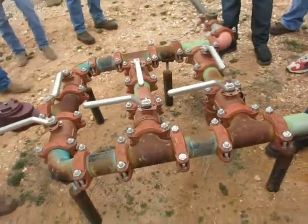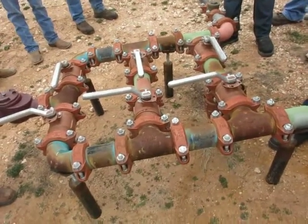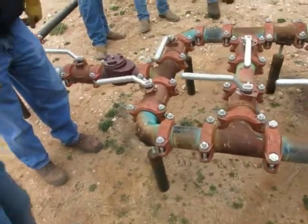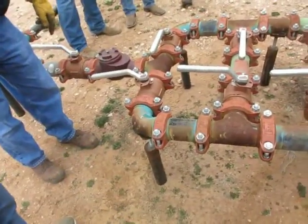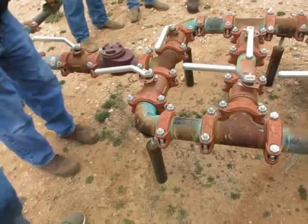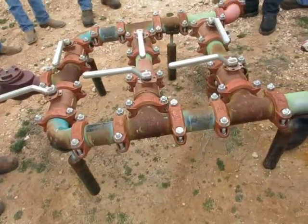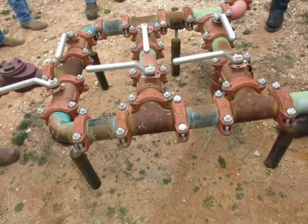What about if one of the wells has high pressure and the other one, like here, everything can mix? Right. So if they're approximately equal, we can bring them all together, and the check valves will keep backflow from going back the other way. Should these two have check valves as well? Yeah, on their lines, they'll have check valves. I just had to wait until I got number two and number three in before I shut the header. Fair enough. So those would be complete wells too. So we test the wells. All right, let's assume we got everything going through production now. Let's follow the production stream.